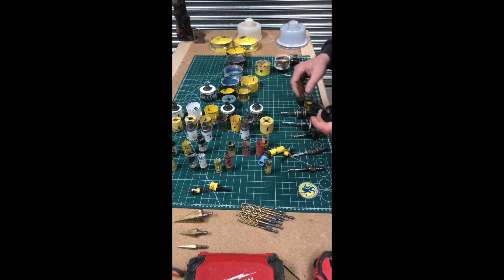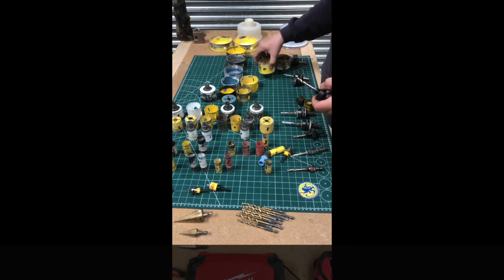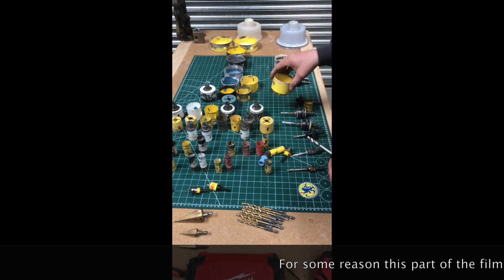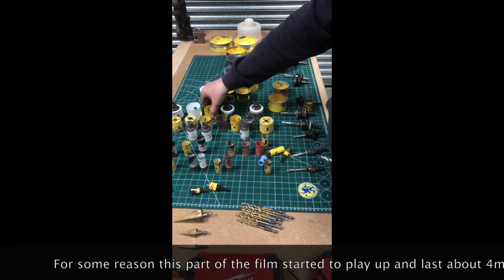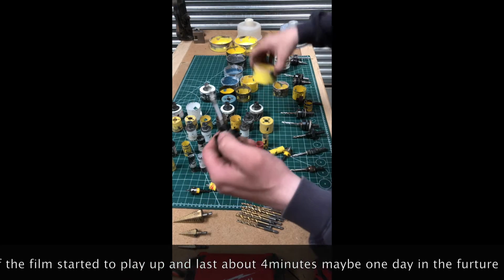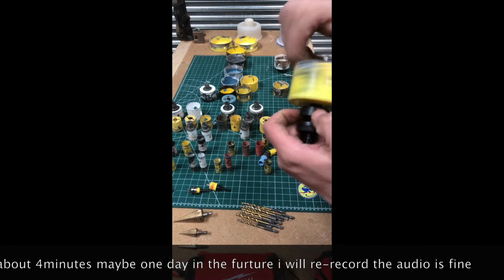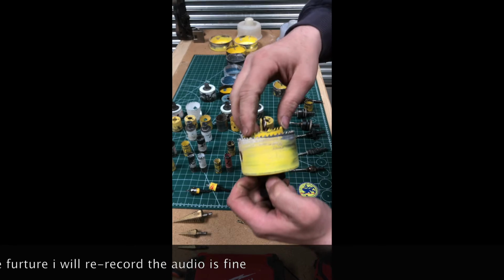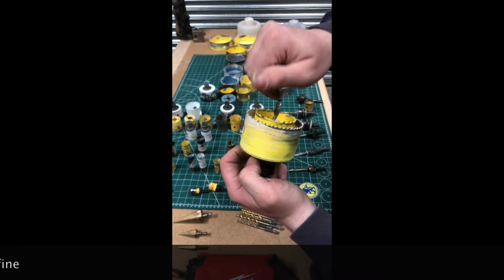Also a lovely little trick. You see where that shank there is really long? If you've got to change downlights and you've got the old non-fire rated ones, they're always about 50 mil, aren't they, or a bit smaller. So say it was 50 mil, that one. Because that shank's bigger, you can fit 2 hole saws on it. You don't need to buy any clever tools or anything like that. It's already done. See that? It's beautiful, isn't it?